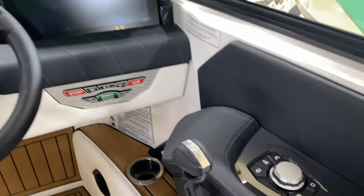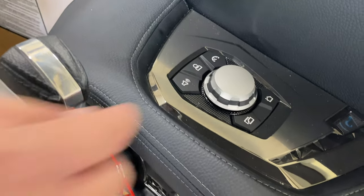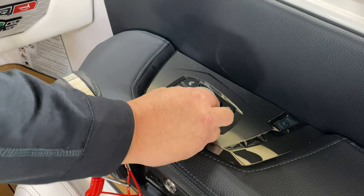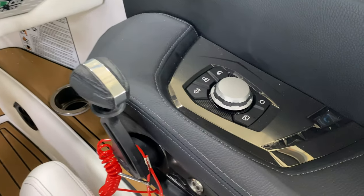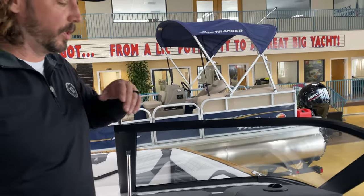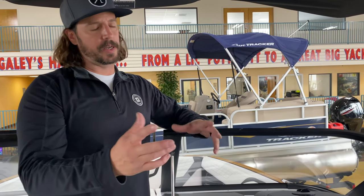The helm command control is a rotary knob that scrolls through options on the current page — it also functions as a joystick to navigate up, down, left, and right. The keypad has quick go-to buttons: a home button to jump back to the home screen, and controls for stereo volume, among others. Most people find their own preferred combination — using the helm command to navigate to a page without looking, then going straight to the touchscreen to toggle a feature on or off.